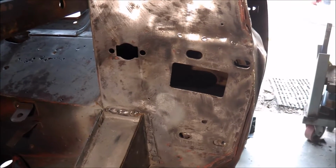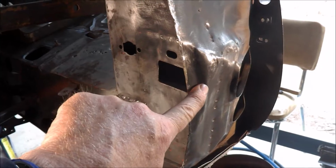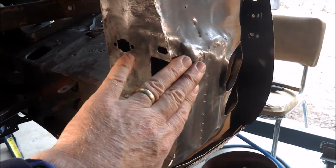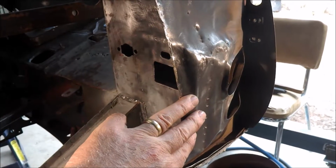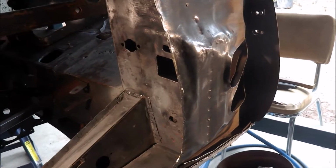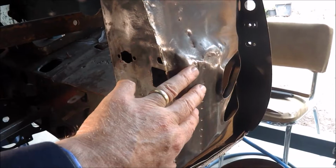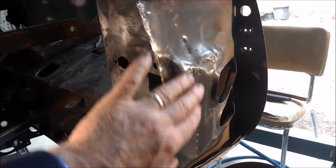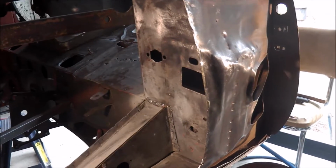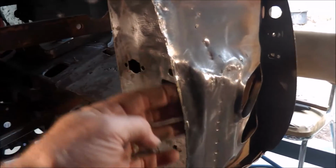I've looked at the door. There's no accident damage on the door, but I suspect there might have been damage to the side panel here. Now, the panel that was on there had no dents in it, so maybe it was a replacement, and this has been damaged, hit in. Although, it's hard to explain why they might have replaced that panel, because everywhere else on the car where they've had a dent, they've used the old dent puller, drilled holes in it and used Nicky. That wasn't done on the panel that I took off here. But I'll never know. So I'll reserve judgment and not blame Jaguar. Maybe blame some subsequent repair.